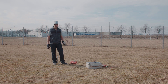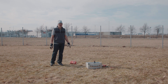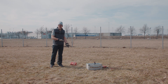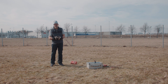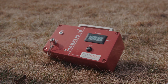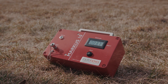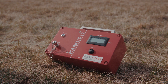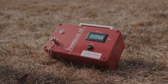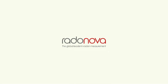I have started the flush, so I have flushed the instrument with fresh air. Now I have to wait 5-6 minutes to be sure that the flush has been working. I can also see that the count rate on the display will be slower and slower. I am sure that the contamination will be gone within 20 minutes. Now we have been waiting between 5 and 8 minutes and we can see that the value is just 3,700. The count rate is almost zero right now because the value is not increasing. So now I can be sure that I am almost on the way to getting rid of the background. Now I make a decision to turn off the instrument. Thank you.